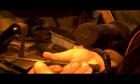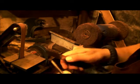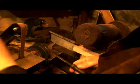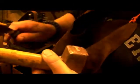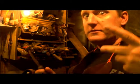So that section I've just dressed up, you see that glint of fresh metal? There's that fresh edge there. Now not only is that better for ferro rods, but it should shave wood. Find a little stick, should be something nearby. Okay, so there's a bit of hickory on a lump hammer, and it shaves hardwood. So that is done by a really cheap, easy to source little mini belt grinder.